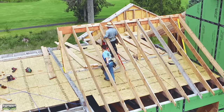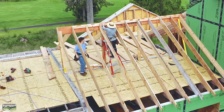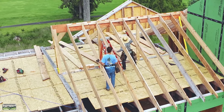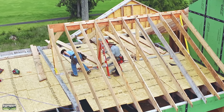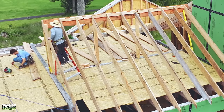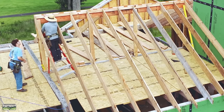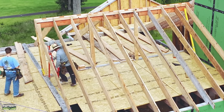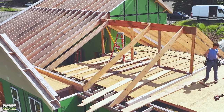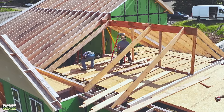From here the notches don't look like much ventilation, but it is plenty — every bird block bay is vented and we've got our ridge vent. We regularly get back into these attics before the house sells, double-check things, and you can feel the air moving. Our climate zone is quite forgiving. You can see we're just being systematic, working our way through. The ridge is posted nice and straight onto that glue-lam that carries the ceiling joists down below.